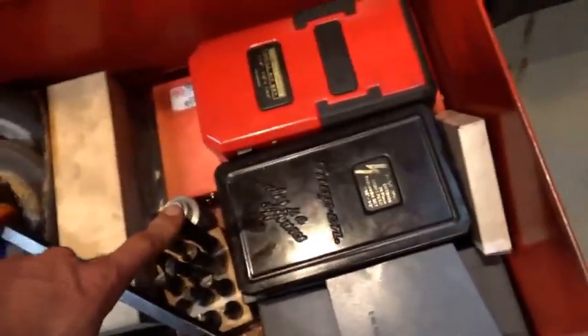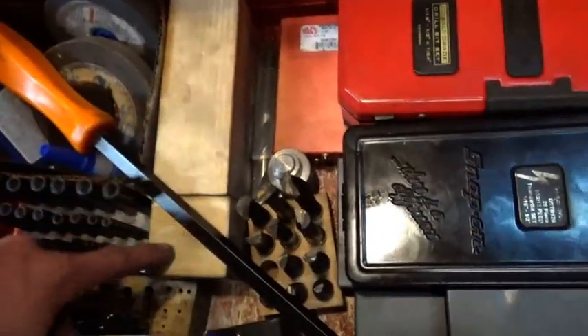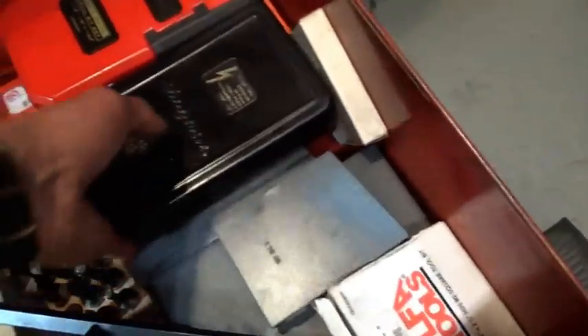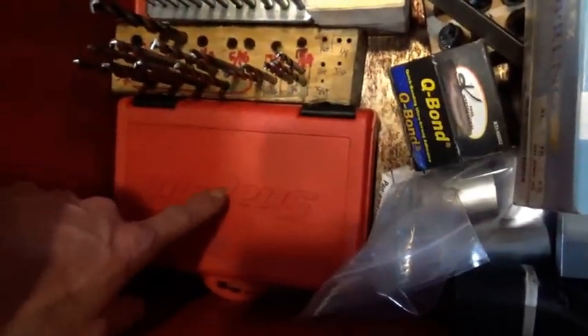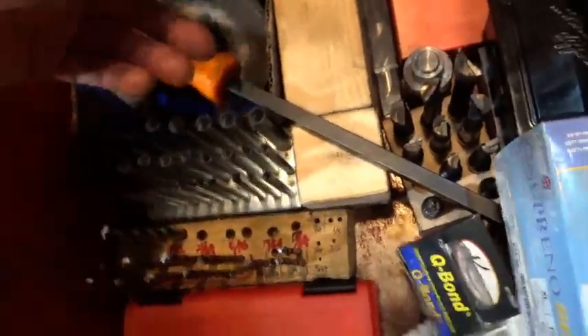The parts bin. A full set of transfer punches — Chinese — boring bars. I've got a boring bar kit down here, an insert boring bar kit. Letter stamps, number stamps. These are just typical fractional drill bits. I have the letter drills, a couple of boxes of high-speed steel tool blanks, number drills, and fractional drills from nine-sixteenths to one inch in sixteenth-inch increments. Some high-pressure lube for the dead center, latex gloves, and precision torque screwdrivers for electronic stuff.